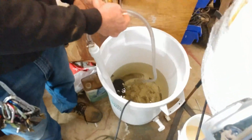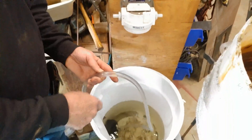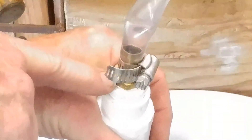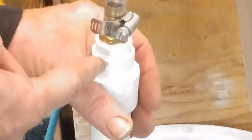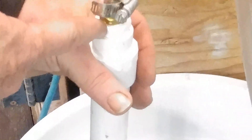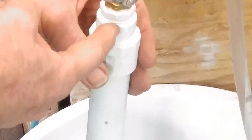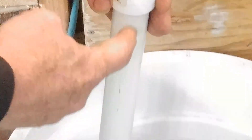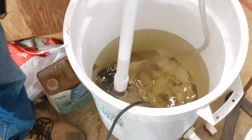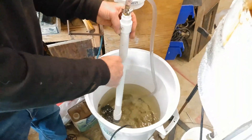For those of you who might want to build one: half-inch vinyl tubing hooks to a pump with whatever fitting works for you. Half-inch to half-inch brass fitting, half-inch barbed to half-inch thread, then a half-inch reducing PVC bushing to three-quarter inch, then a three-quarter inch threaded to one-inch slip, then one-inch PVC. Next time you see a video from us, this pipe will be a clear pipe so we will be able to look inside.